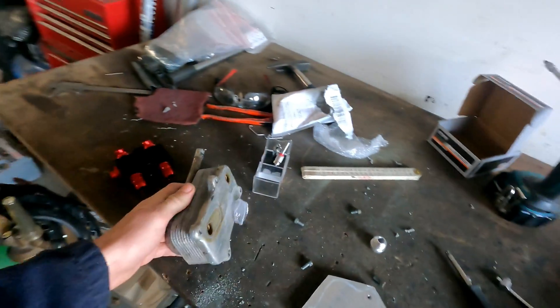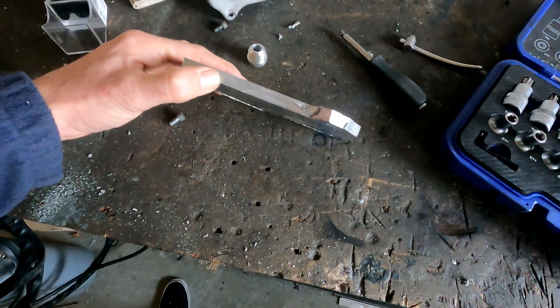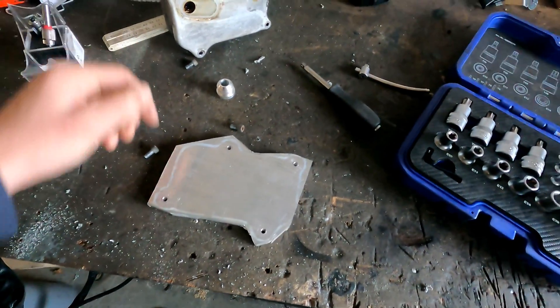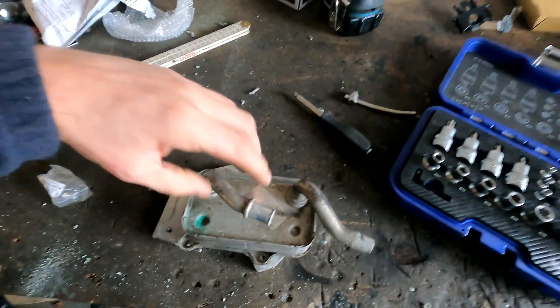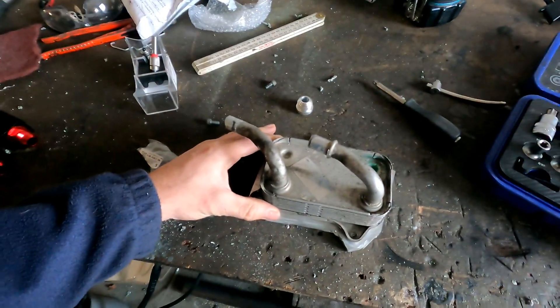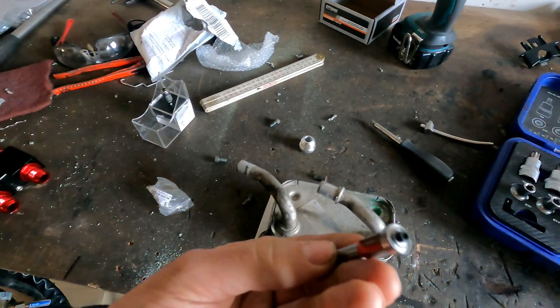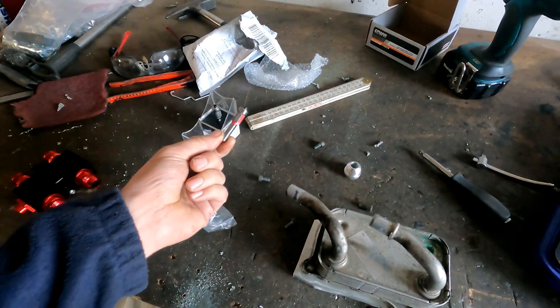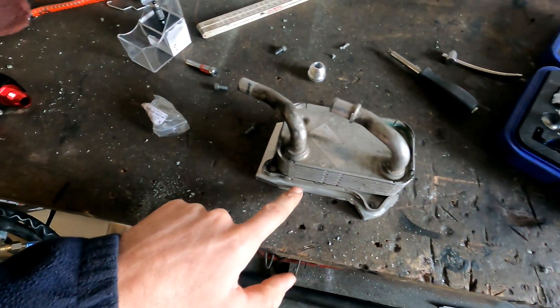What I'm going to do is make an adapter plate for it. This only has two holes in it. I've just cut out very roughly an aluminium plate, 10mm thick. I will bolt this on there and use the wood router with normal bits. Last time I lost the bearings, so I put new bearings on it — they still show up. I'm going to use the same way of doing it, make a nice even cut all around.